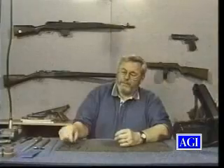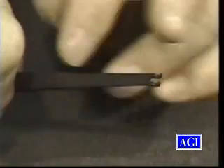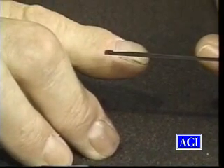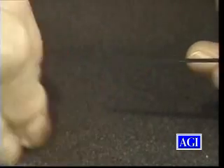On the Smith and Wesson spring, we have the front end retained by the hammer stirrup, but the tail end has a little bobble on it — you see it sticking up there? — and that retains the spring so it can't move in and out of the frame. So most springs are going to have some way of retaining them. Of course, the Colt Single Action Army spring has a hole for a screw.